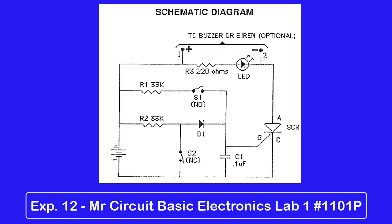When a door you are protecting with a normally open switch is opened, the switch closes, which sends a positive voltage to the gate of the SCR. The SCR conducts current to the alarm buzzer or bell, and the bell would keep ringing even if the door were closed again. You can see how this would be a good thing.